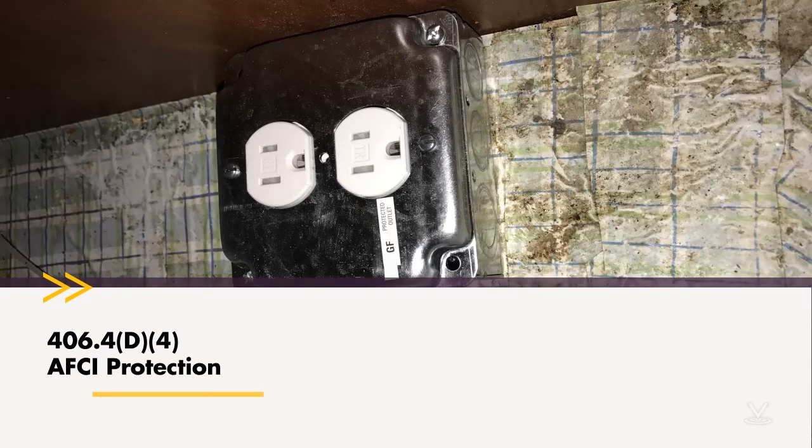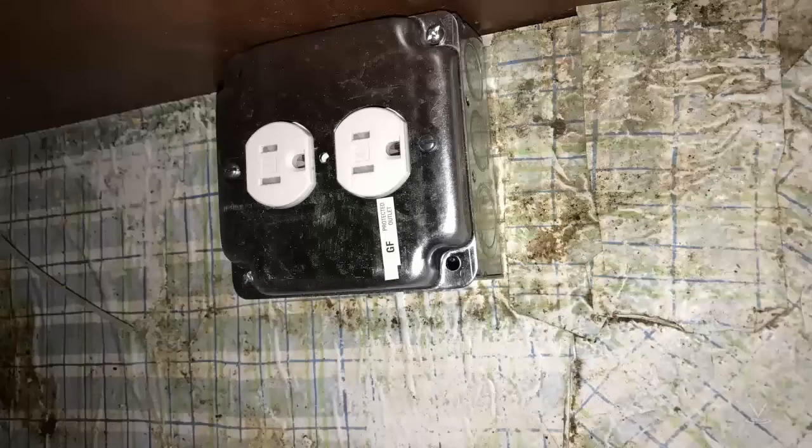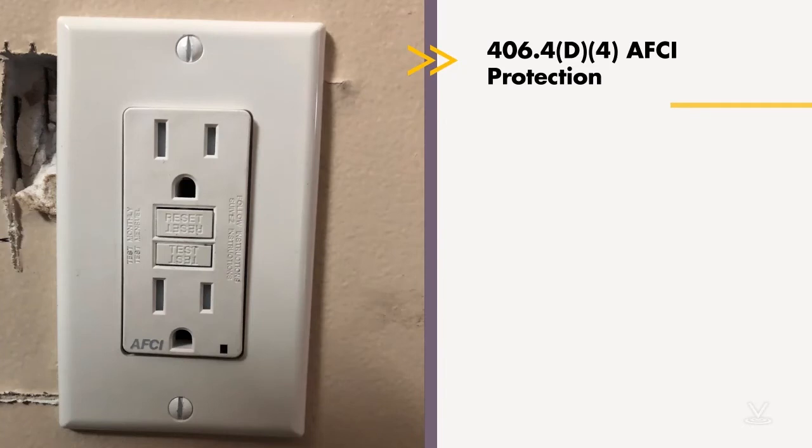What changed is subsection 4, which talks about AFCIs. If replacements are made at any location that now requires AFCI protection, the replacement must be AFCI protected by a method indicated in items one, two, or three. AFCI protection locations are found in section 210.12 of the NEC — required for dwelling units, dormitories, guest rooms and suites of hotels and motels, and assisted living facilities. Option one is a listed AFCI type receptacle — as shown in the photograph, you simply remove the old receptacle and replace it with an AFCI receptacle.